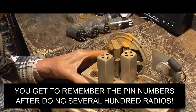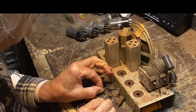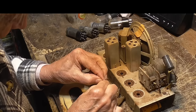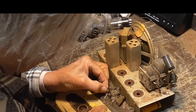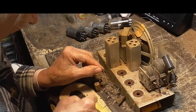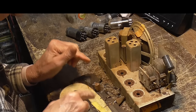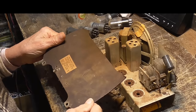Okay. Now, this is peanut brittle wire. Peanut brittle wire is wire that when you bend it the insulation cracks off. Alright. So, that one's okay, and this one's okay. It's just this one wire that's peanut brittle. So I'm going to just take it, we'll just pull it out of there and we'll put another piece of wire.